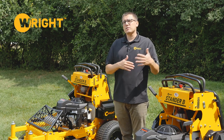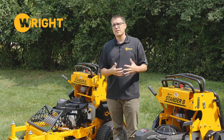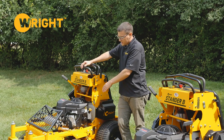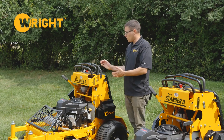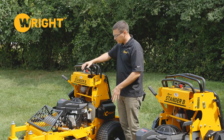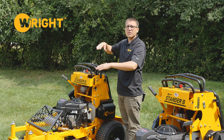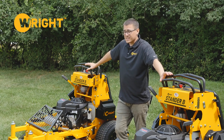So what makes these mowers a lower cost than some of our other machines? These machines have a couple things that stand out different than the Intensity or Stander X, starting with the small machine. We have an integrated transmission — a left trans-axle and a right trans-axle underneath — and those allow us to reduce the amount of parts we use to build the mower pretty significantly. The trade-off is that we have to move where you stand back about two or three inches because of where those transmissions sit. Also, because the engine is connected to those transmissions at a fixed height, the deck is very close to the engine, so when the deck goes up and down, the belt has to take a taper angle at the limits of the cut, which will result in fatigue on the belt eventually, but it also lets us significantly simplify the machine.